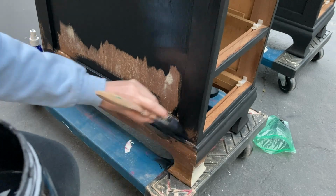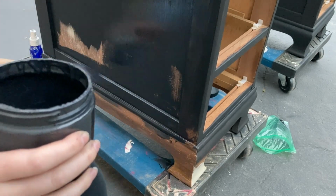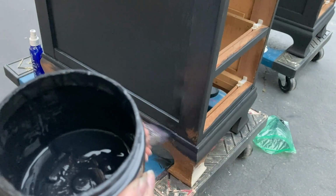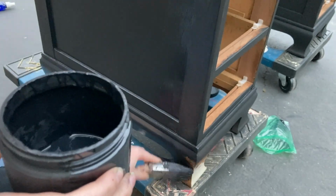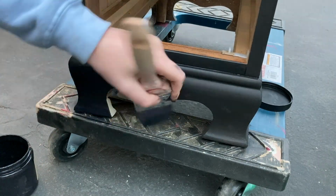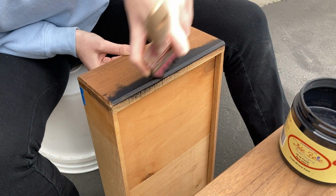In just a second, I'm going to show you this foot here that I repaired. I used a technique by Cristana from Bella Renovare here on YouTube. I made a mold of another leg using hot glue, and then I filled that mold with Bondo, and then I shaped it and sanded it and created this foot here, and I attached it with some heavy duty glue. And as you can see, as I paint over it, it is completely seamless. So if you guys are looking for a similar repair for a piece, I will have that tutorial linked in the description.